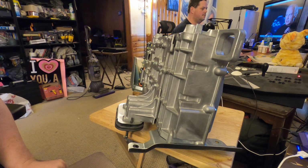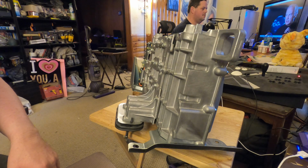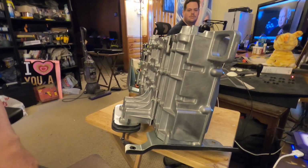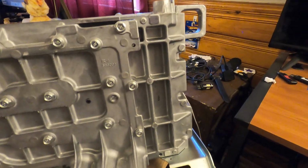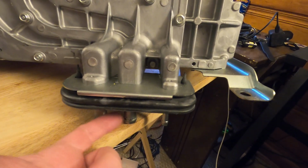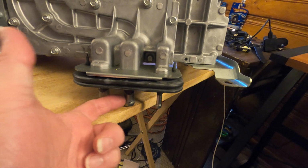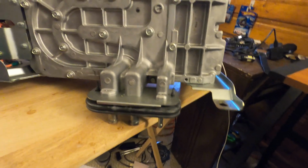We'll do a little bit of a circle around before we start finagling this thing, because I'm going to try to take a few bits apart here in such a way that this shaky little table it's sitting on is safe to do so. Along the back, you can see this is the piece down here that goes through the floor of the car, and is the one thing that requires you, aside from disconnecting the high voltage battery so you can do this safely, to undo a whole lot of plastic underneath the car to get to it. If it wasn't for this, everything would have been up top from the inside.